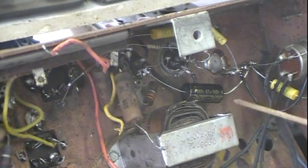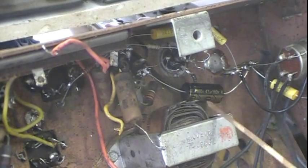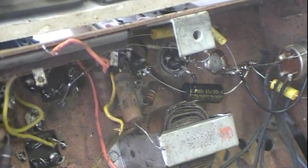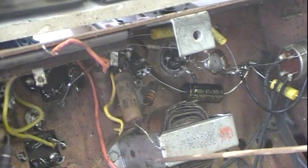This is the audio section and several of the resistors were out of tolerance in that area, so I'm replacing quite a few of them. The audio output transformer is actually a different one as far as the main core goes. I did put it inside the metal enclosure that bolts it down — that was with the TV. It happened to be virtually the same size as the core and transformer, but the transformer in this had an open primary.